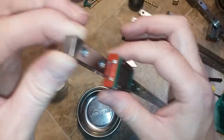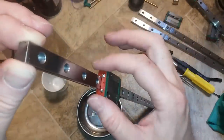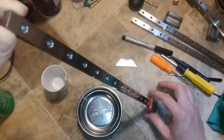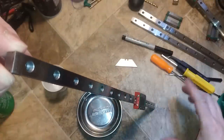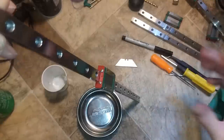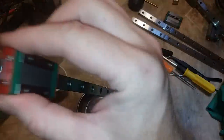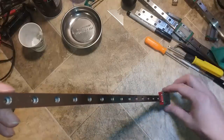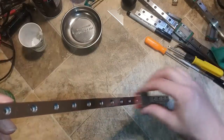Here's one that hasn't been cleaned — this is factory gunk all over it. It'll slide, but it's not like the clean ones. You can see there's a lot of drag because it hasn't been cleaned and hasn't been lubricated. So this is how you can fix your cheap Chinese linear bearings to make sure they run smooth.